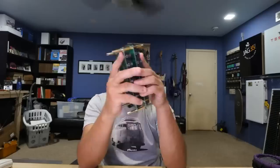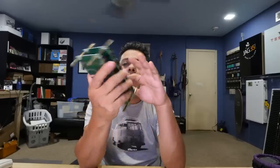Hopefully that generates some profit so that I can afford to buy batteries so that I can work on the Samba. The Samba needs a new battery. I want to make whole new, brand new modules built using PCBs. Not this design. I'm thinking of a different design to use on the bus, because this is not energy dense, right? See, there's a lot of space between the cells. There's only 7 cells. Obviously this is not right when you're working on a vehicle, where you're trying to cram as much battery as you can in there. It's also challenging because of all the vibrations and the wild temperature swings that a battery will see on a car. So yeah, batteries for electric vehicles are coming. I just do what I can. I still can't afford the batteries.